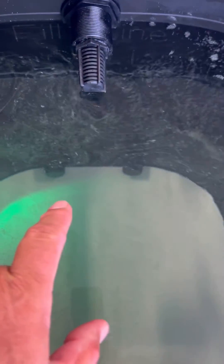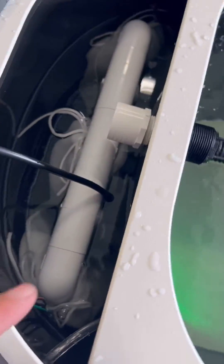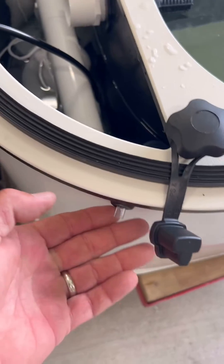As the lower screen caps, the dirty water goes in and comes into a triple sock filter system. As that filtered water hits the bottom, those pumps pick it up, and here is your air line that infuses air back into the water. So your bait is getting a constant flow of filtered, oxygenated water.